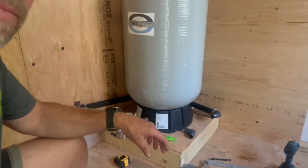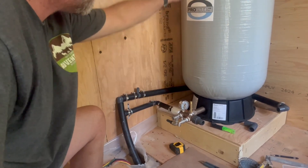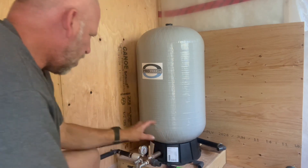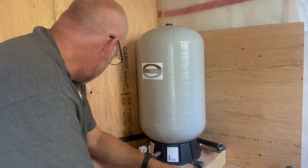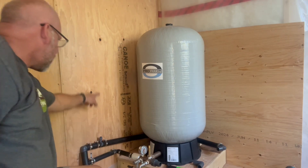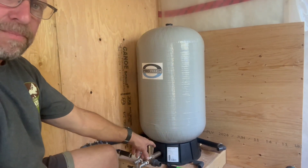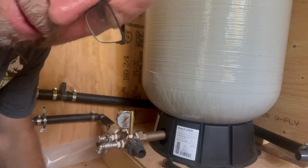We're working back in the utility room and I have a pressure tank behind me. The water coming up from the well comes over into the pressure tank, fills back out, goes around there and then back down this big pipe over to the house site. What I want to do is put a shutoff right here — in case of an emergency I can have water in here but shut it off at the house. This line here will be the water for the washing machine and things like that. I built a little base so it sits up.